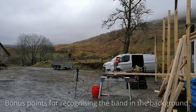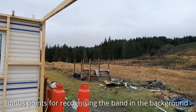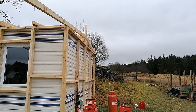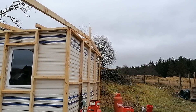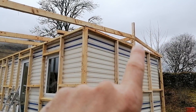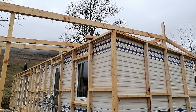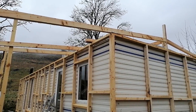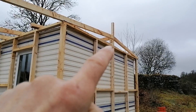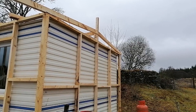Six degrees is what it's worked out at. I left that central stud high — you can see it up there — higher than it needs to be. That gave me a chance to clamp the outside rafter to it and rest it on this corner. I clamped it here, rested it on this corner, just to see what kind of angle I would get. Once I was happy with that angle I cut that rafter into place, then I put a block on the inside of that upright to rest the ridge on.